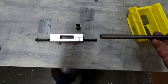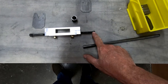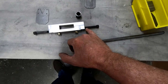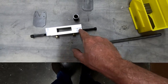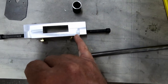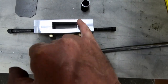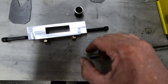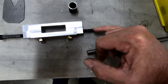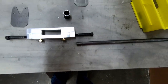I'm going to start off right now by just cutting these tubes to fit on top of here. They're supposed to be, I think, 25 millimeters. These bolts do need to be cut down. I bought these extra long, knowing that I needed a certain amount of grip length, but the threads are really long on these bolts, so I'll end up cutting off the threads, because the only part that needs to be threaded is from the inside of the bottom fitting on into where it's going to hit this bolt that goes in here. That's the only threaded part there is, and then this shaft part of this bolt will actually be inside of here and also be inside of whatever I make here for an inner bushing that is about 25 millimeters.